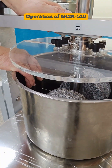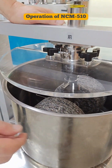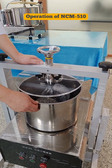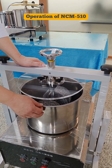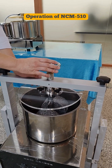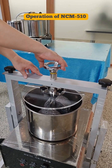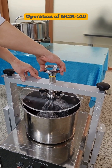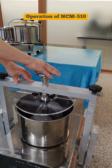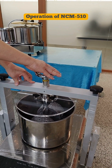This is the silver flag to circulate the materials. The capacity of the container is about 8 kilograms. This is the pressure adjusting device, to be used as needed. When you turn clockwise, you increase the pressure on the stone. However, it is recommended to keep only slight contact between the stone and the base.